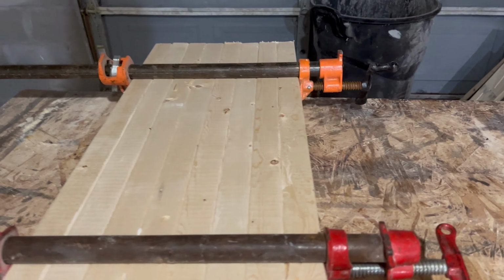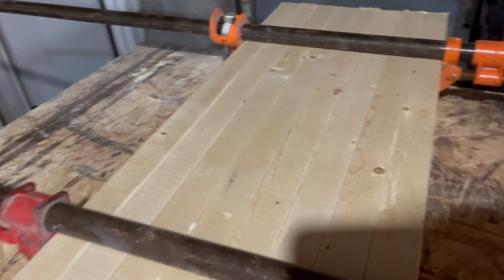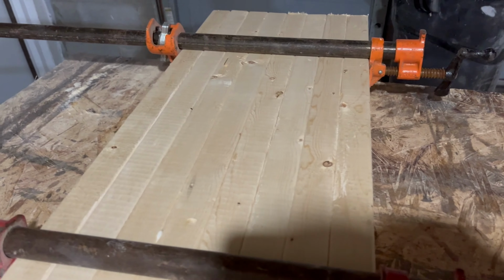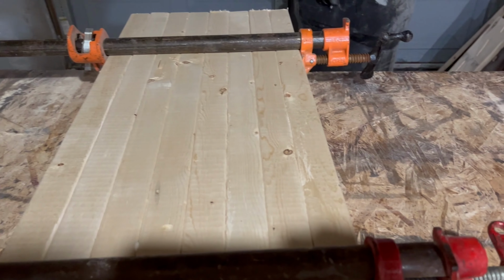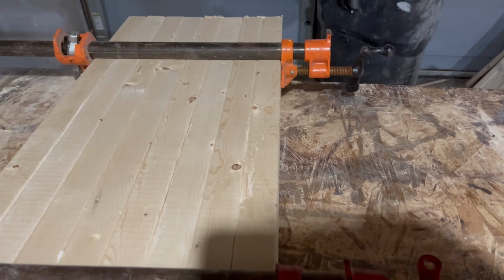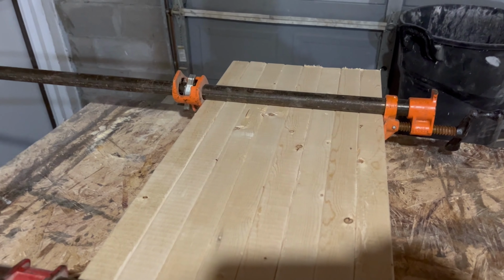But I think come morning, like I said, we're going to cut the ends off, about 1/4 inch off each side, then crosscut them up to our 29 1/4, and then we'll do some routing on here and make a nice leg out of them. And I think that should be just dandy peachy fine.